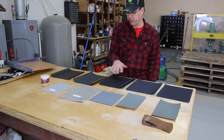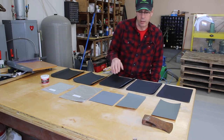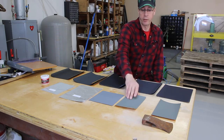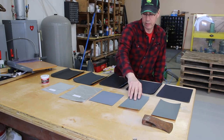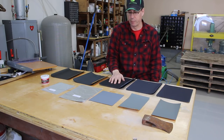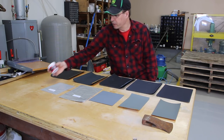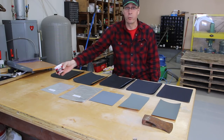This sandpaper is all automotive sandpaper and you can get that at your local automotive store. The highest grit you will usually find there is 2500 grit - usually that's the finest they carry. In the description below I will put where you can get the finer grit sandpaper. I got it at sandpaper.ca - that's for the 4000 grit, 8000 grit and 10,000 grit. The metal polish you can get at your local automotive dealer.